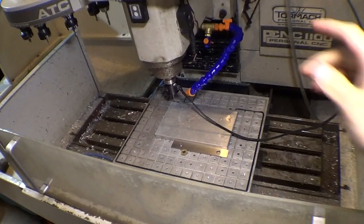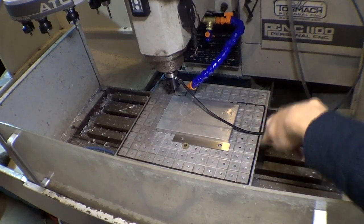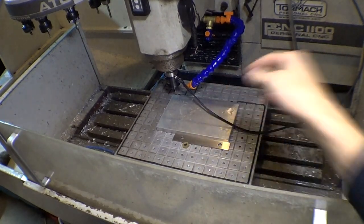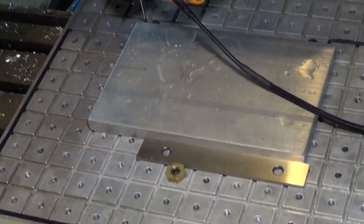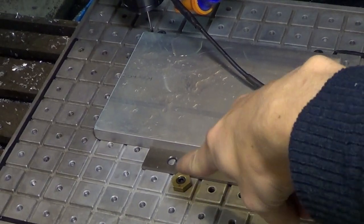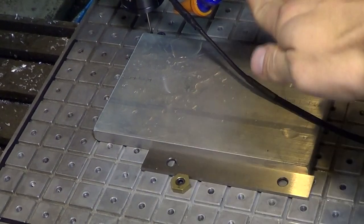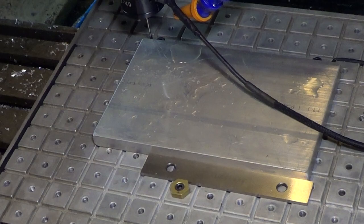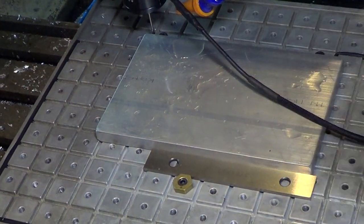I've got another piece going right here. I've got it on the Vac Magic with vacuum suction, a big black o-ring going around underneath the part. Just for some added security, I'm using a brass mighty bite cam action clamp — it sort of pushes it up just a little bit, which helps keep it positionally stable left and right, whereas the vacuum holds it down really well.